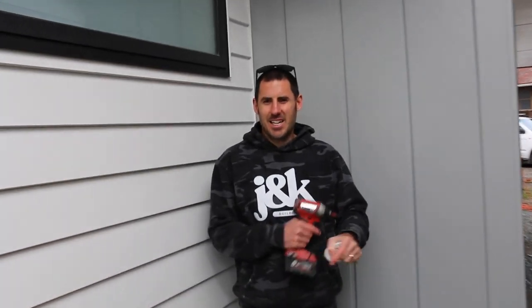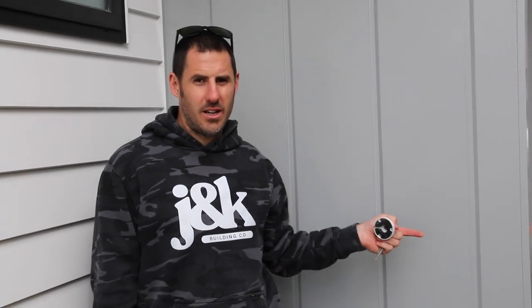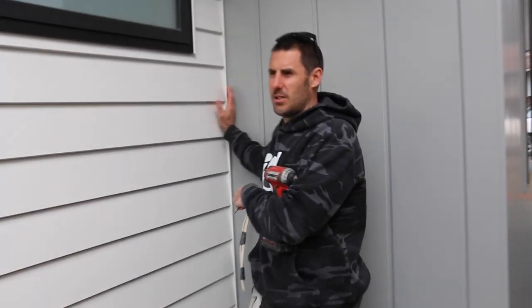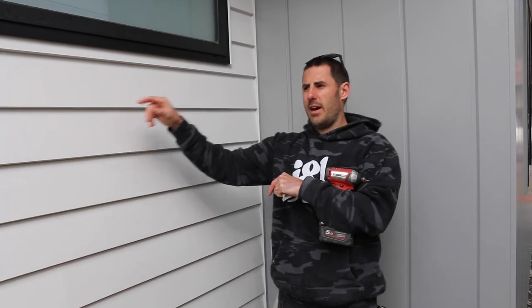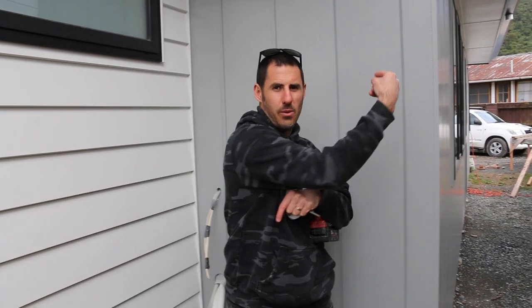So this is another classic horizontal linear weatherboard and vertical linear oblique. Normally we always like to meet that in an internal junction. This is an exterior corner, this is an internal corner. It's always good to change your cladding on the internal corner, makes things really easy, nice clean way. So this side goes all the way around to the other side of the front door. This side goes that way to the front door.